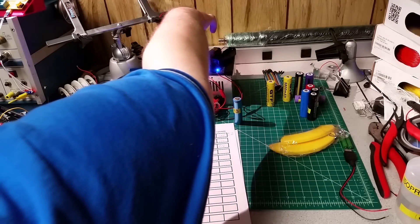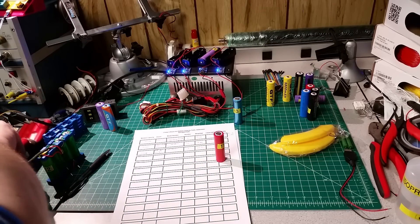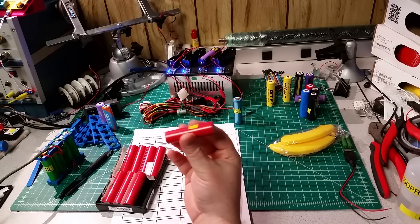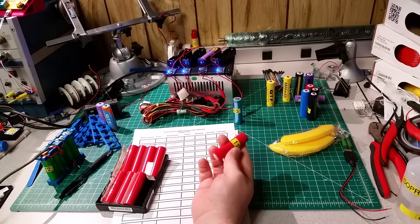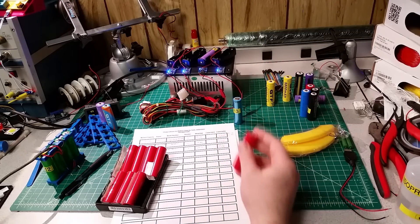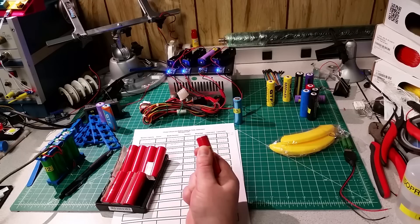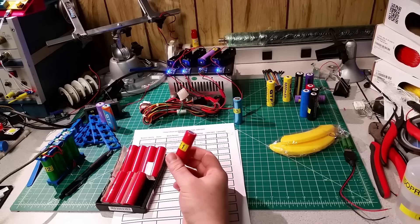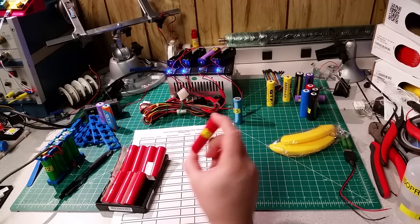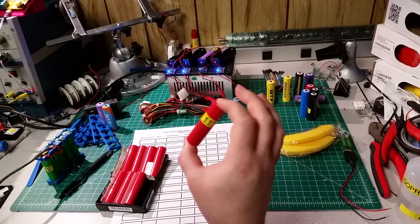But we do have a clear winner. We have our Yiklik brand laptop batteries pulled out of a pack, which are rated 2,200 milliamp-hours by the manufacturer. When I tested them, they ran at 2,210 milliamp-hours. I cranked up the current even higher - brought it to one amp with the constant current load - and got 2,145 milliamp-hours. So these are excellent cells, doing exactly what I need. The capacity is right where it should be, and these blow away every other cell I bought from China. None of them hit the 2,200 milliamp-hour mark. None of them even hit the 2,000 milliamp-hour mark.